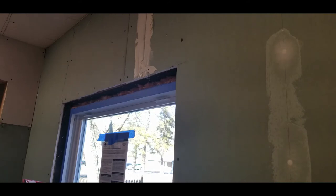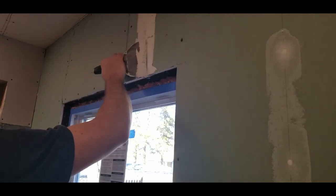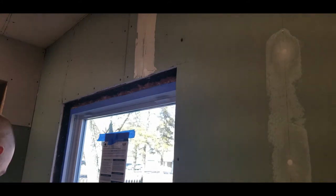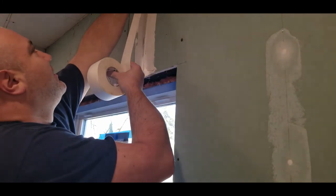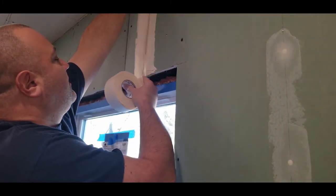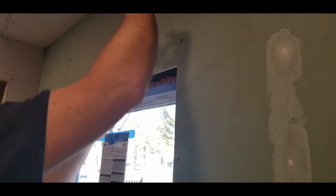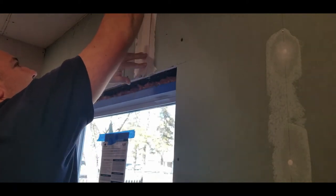It's kind of like paint. The rule for paint is get the paint where it ain't. Thin it out. And you take your tape. I know they have the self-sticking and the mesh, but I still swear by good old-fashioned paper. And there's no rules. There's more than one way to skin a cat. Some people wet the tape so it'll stick better.